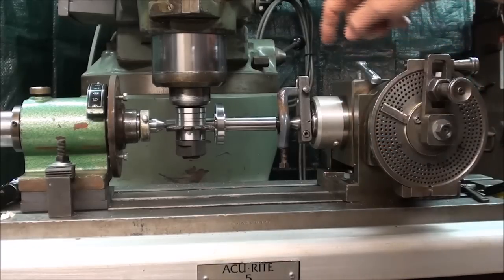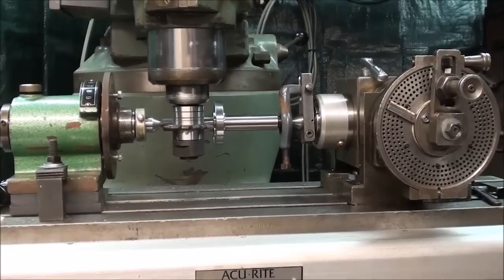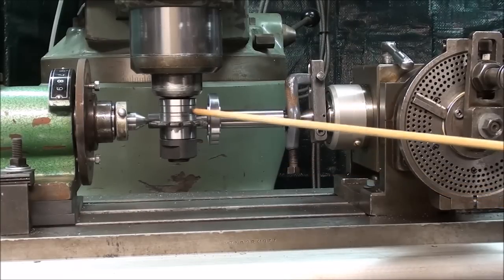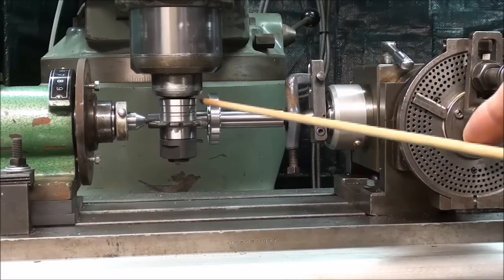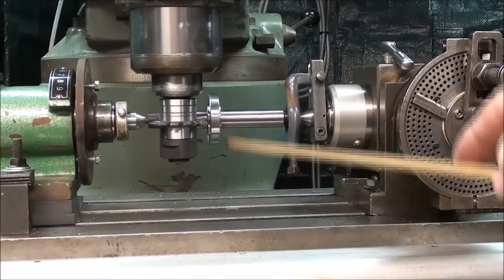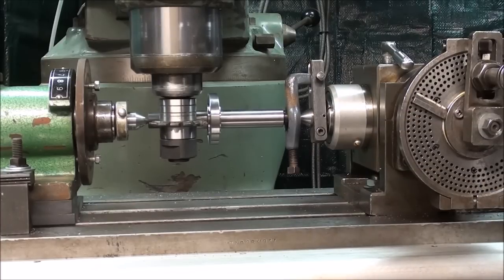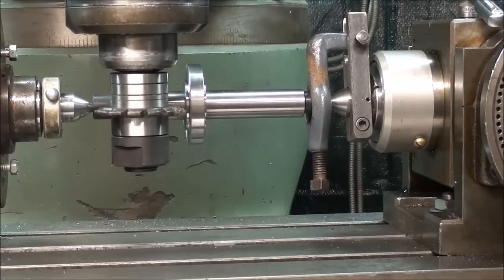The cutter is mounted in my arbor — a 7/8 arbor with a 3/4 shank, held in a 3/4 collet. The next thing I need to do is determine that the cutter is exactly at the right elevation — on the centerline of the arbor, the center of the gear. I'm going to touch off. You need a tool bit or some other small parallel; this high-speed steel tool bit is ground and straight, so it's just perfect for the job. Wiping the cutter off and using a spring clamp, I'm going to clamp that tool bit right on top of the cutter.